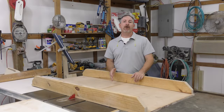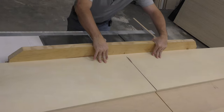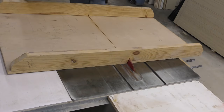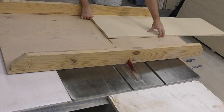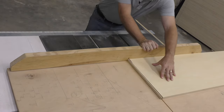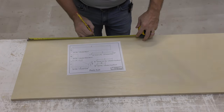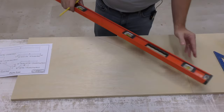Now that we have all of the parts cut for our mast, I want to come back over to the table saw and work on the pieces we need to make up our base. We're going to start by taking our 16 inch rips over to the crosscut sled and squaring up two ends of a five-foot piece. We'll have a three-foot drop left over that we'll set to the side and come back to. Now we'll use our paperwork to lay out one of the legs, then lay out the other three from that pattern.